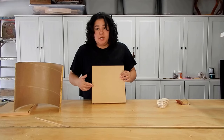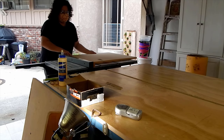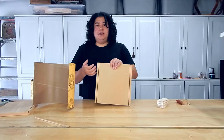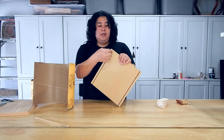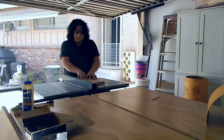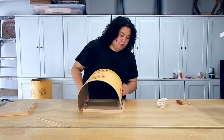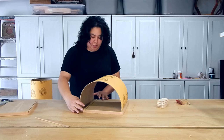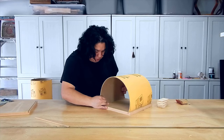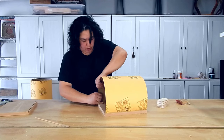The next thing I did was cut up a piece of MDF to serve as my bottom base. After cutting it down to the size I needed, I went in and added a notched groove on my table saw. This is going to allow my cardboard form to have somewhere to sit, so I can just pop it in on each end. My ends are a little jagged because I used scissors to cut, but a little sanding and coaxing will get it where it needs to go.